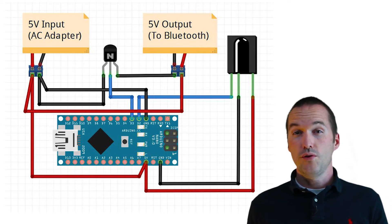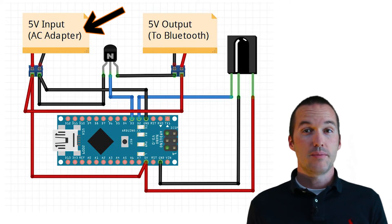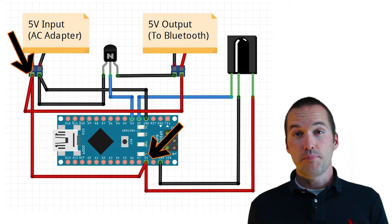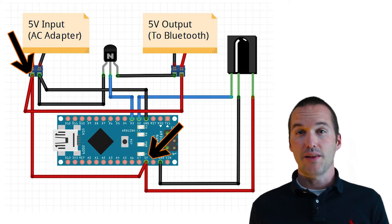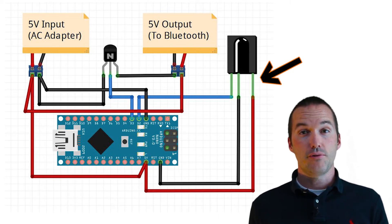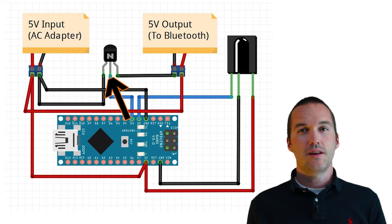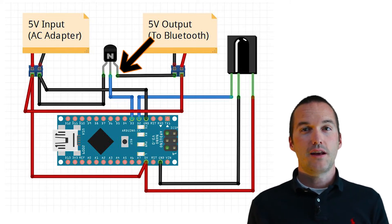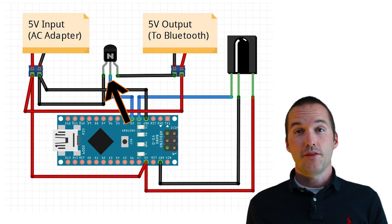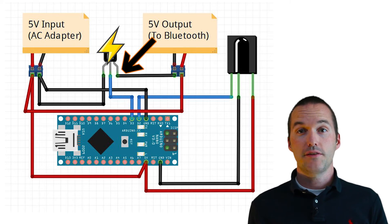The basic circuit looks like this. We'll use the 1A 5V power supply from our Bluetooth receiver to power both the Arduino Nano and the Bluetooth receiver. I hooked up the positive wire from the adapter to the 5V pin on the Nano, because the power supply itself was regulated — but if you're using a power supply with a voltage other than 5V, you'd need to hook it up to the VIN pin instead. We hook up the VCC pin on the IR receiver to 5V and the ground to ground, then the output goes to D2 on the Arduino Nano. The base pin on the NPN transistor is connected to D3 on the Arduino Nano, the collector connected to the negative wire on the Bluetooth receiver, and the emitter connected to ground. The basic idea is that the base on the transistor controls whether current can flow from the collector to the emitter, acting as a switch for the negative wire on the Bluetooth receiver's power supply.